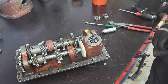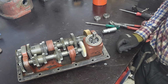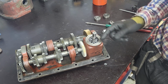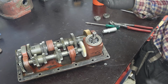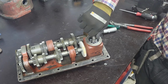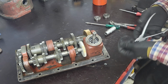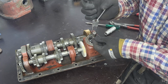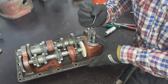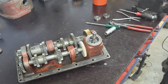Good. Okay, we forgot to press record, but we also pressed in this bearing. We came to the conclusion that we could press it easily and it actually went quite smoothly once we got over this first part. I think there were just some minor burrs on the shaft. So I think that's quite good, and it rolls really smoothly and nicely. Yes. So last off, the locking washer, which snapped in place. Excellent.